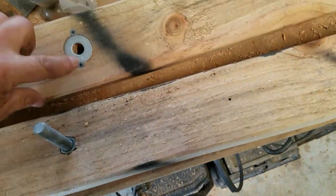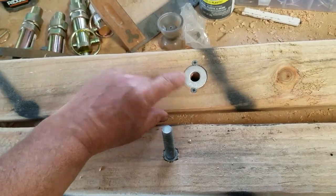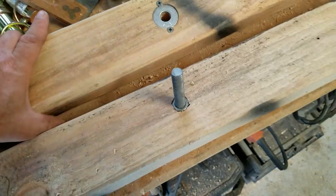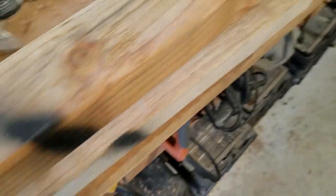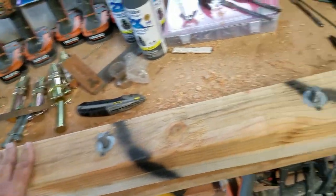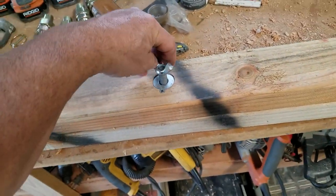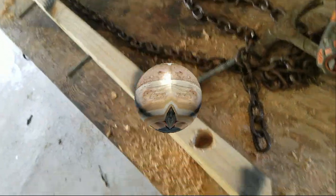I also don't want to deal with washers out there, so I just put a couple of screws and inset these with a one-and-three-sixteenths Forstner bit. What you do is put these right on there, wing nut them down, and then this will clamp your fence so you can draw it.